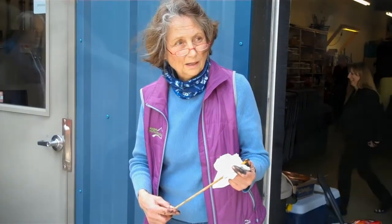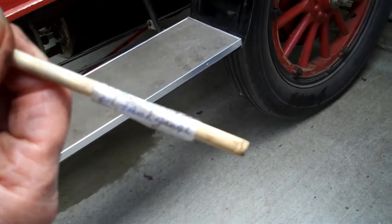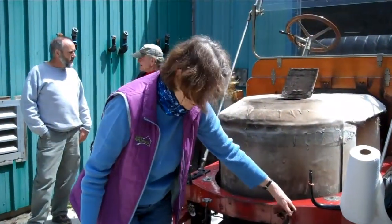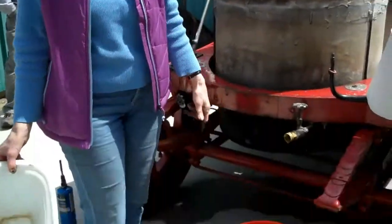Okay, and it takes a steam cylinder oil because we have two or three buckets. A little label on a piece on a stick, right? So this is the cylinder oil. That's a special oil made just for steam engines. Yes, it's a very heavyweight. It's because we're making room for steam. So you've taken 5 gallons out of a totally filled boiler. Yeah, so now we've got 20 gallons of water in.